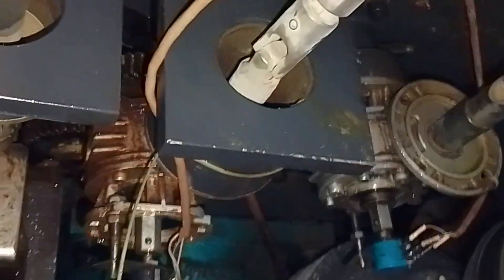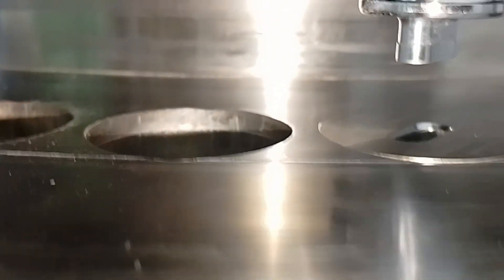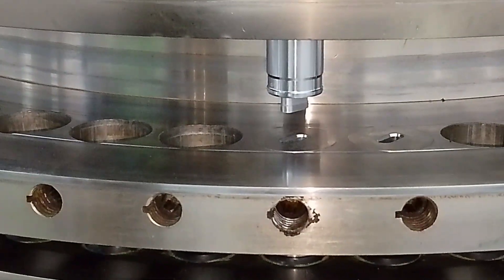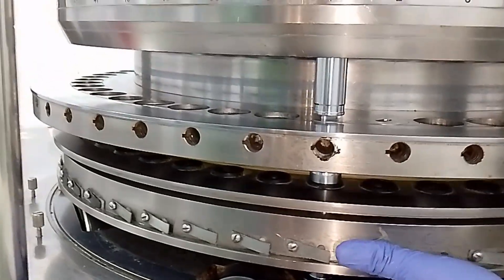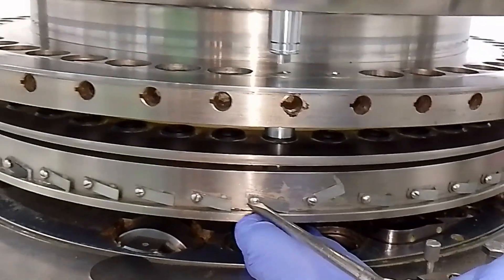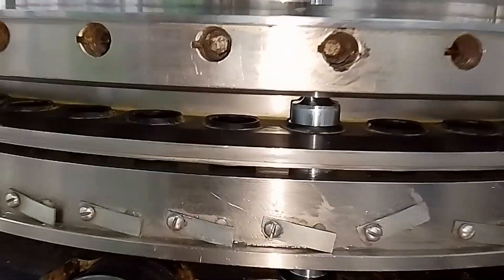After lubricating, insert the lower punch from below. I have removed its lock from below. From here we insert this punch — the method of inserting is very easy. Check the same alignment. Insert the lower punch and take it out till the top to see if any sound is coming. Check properly whether its alignment with the die is proper or not. After checking, take it a little forward and lock it. With the help of a screwdriver, lock the lower punch. Remember that the lock of the punch should not be too tight — tighten it just enough so that the punch will not fall and will remain smooth. One side is now completed: upper punch, lower punch, and die have been set properly.